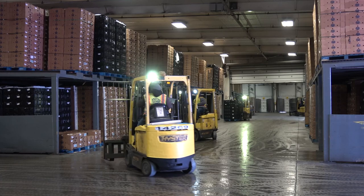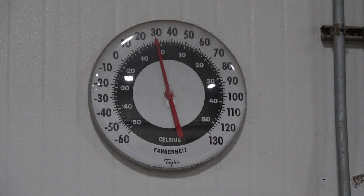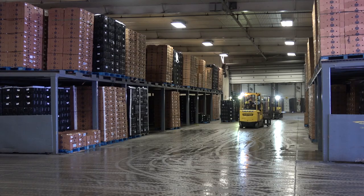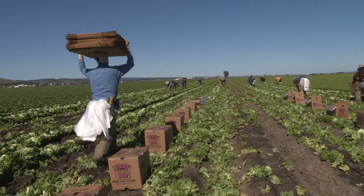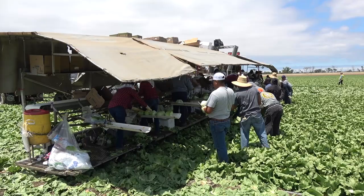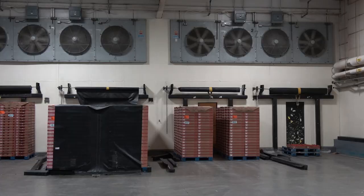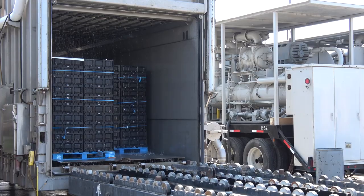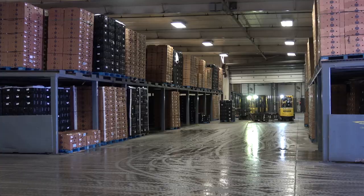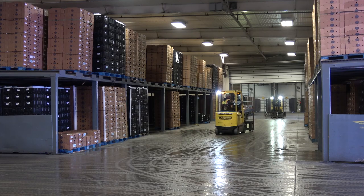Once pre-cooled, vegetables are placed in refrigerated storage until ready for shipment. The storage area, staging area, and transport trucks are all kept at 34 to 36 degrees so that the vegetables don't reheat, ensuring the highest quality. Vegetables are high-value, nutritionally dense, but highly perishable crops. Controlling respiration is necessary to maintain shelf life, and pre-cooling — the quick removal of a commodity's heat — can be done five ways: using cold air, cold water, ice, a vacuum, or a vacuum with water. By pre-cooling and then refrigerating vegetables, California has become the leader in vegetable production in the US, shipping safe, high-quality vegetables both nationally and worldwide.